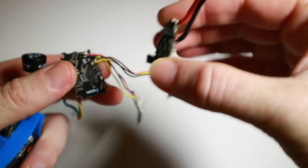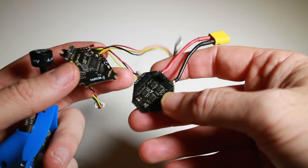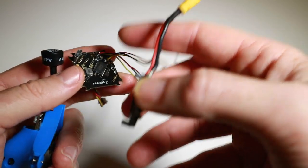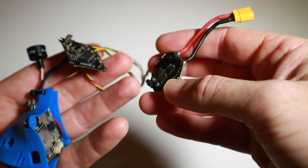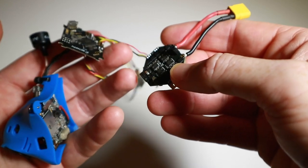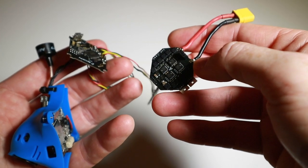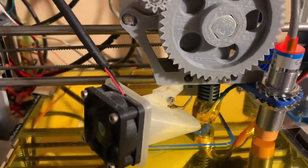As I stripped things down I noticed two interesting things. The original board is in two pieces — the ESC part and the flight controller — whereas the new one is a single board. The new one has 32-bit ESCs and can run DShot 1200, where the other is a DShot 600 board. I thought about 3D printing something, went on Thingiverse, and found a frame called the Calamero by DaveCFPV.